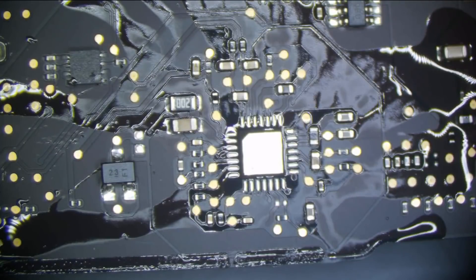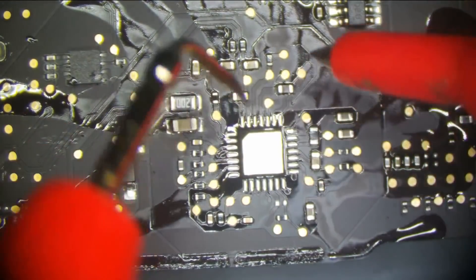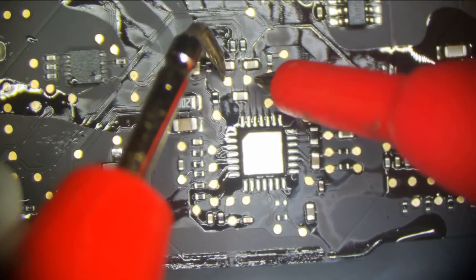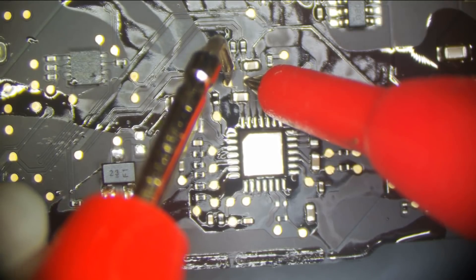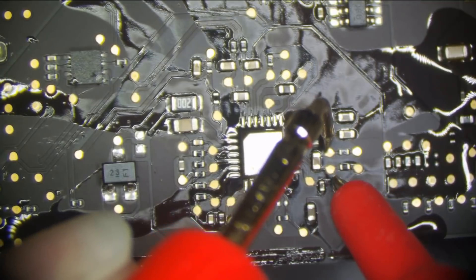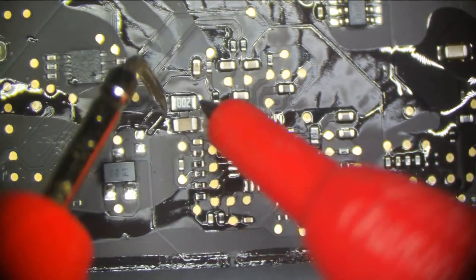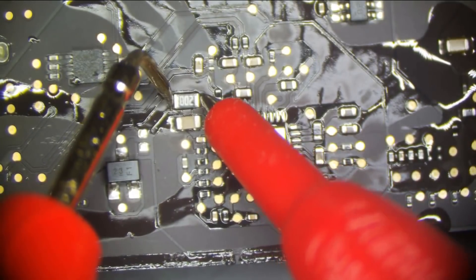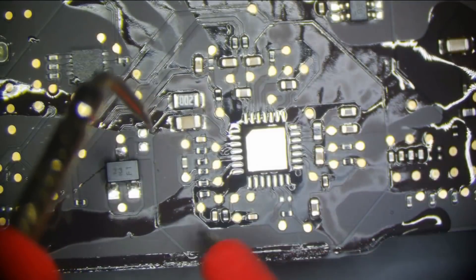While the ISL is off, let's go ahead and check our current sensing circuit. We're going to do this by measuring between pins 27 and 28, and 17 and 18. We have 20 ohms, which is in spec, and then 3 ohms here, which is also in spec. That resistor looks good — could still have an issue around here, but not too certain.